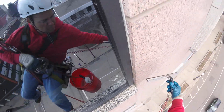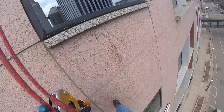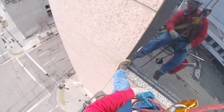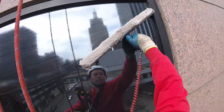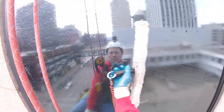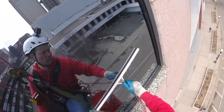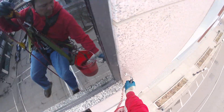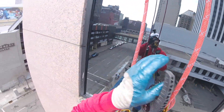Squeegeeing the sills, replacing all the tools. This Petzl ID has been a great system for us — no user error. If the user lets go at any time, it locks up. So we stop rappelling, grab the suction cup for the glass, grab behind where the suction is, and back on. Window cleaning is just repeating a process over and over — most buildings have a similar window style throughout, which helps for efficiency. Watch how we have the suction cup on the glass and remove it at the right moment. Once we're done with the suction cup, it's just dropping it out of our hand — it's on the lanyard, it's safe. Be comfortable where your tools are located, and when you let go of them, they have safety lanyards on them and they're going to stay there.